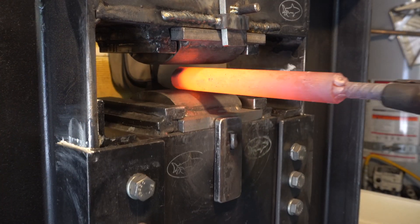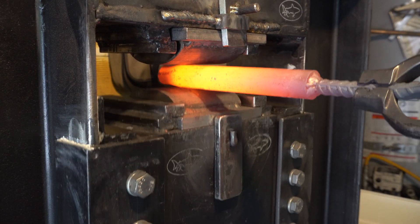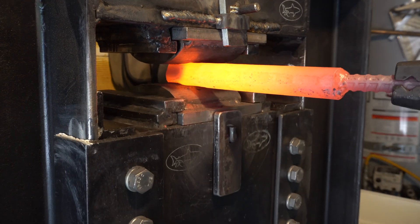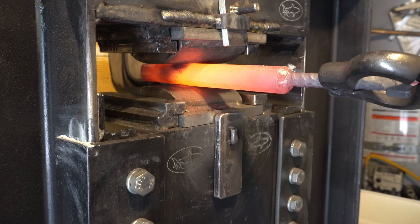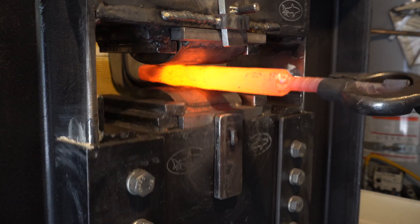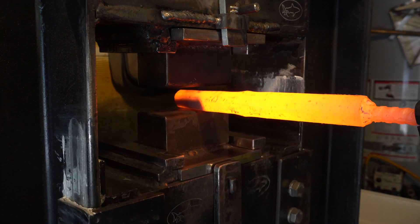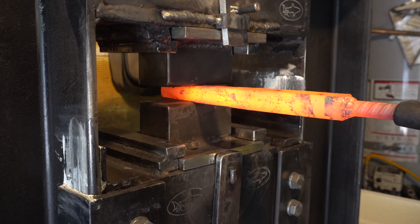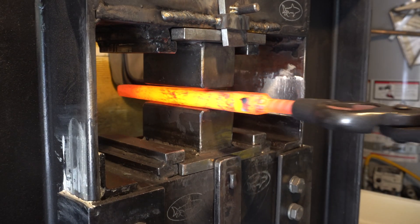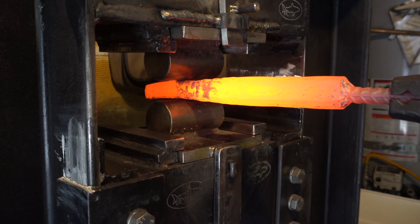Now I'm starting to work on the drift. The drift is meant to use with a hand hammer, just hammering it through the area that you punched. So this thing needs to taper pretty generously from the end. As you can see, it took a bunch of heats to get this taper down to where I wanted it before I started shaping it. You can see I'm getting quite a bit more length in the drift and now I'm starting to put in the shape.